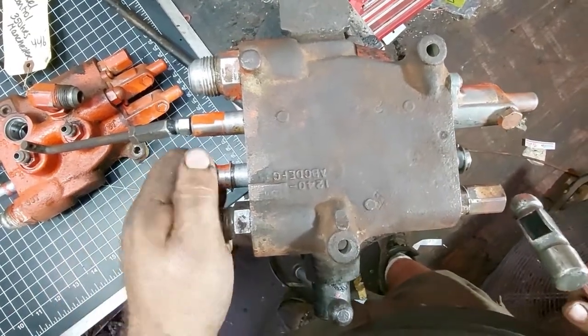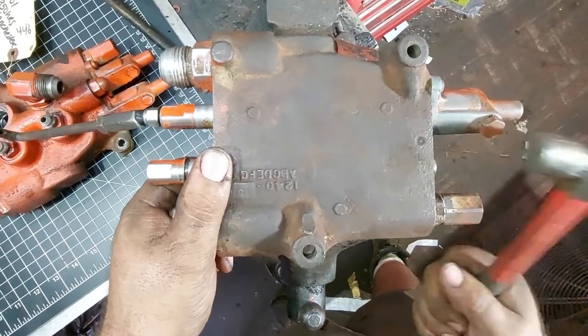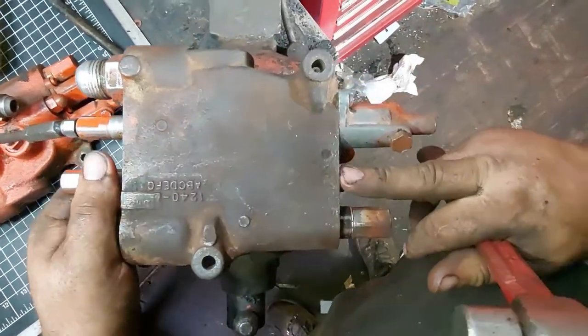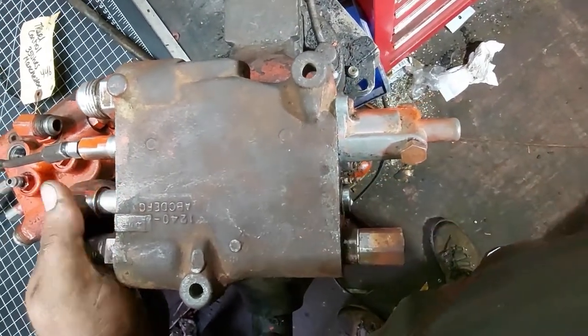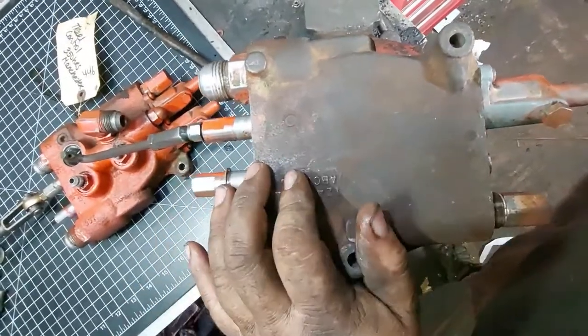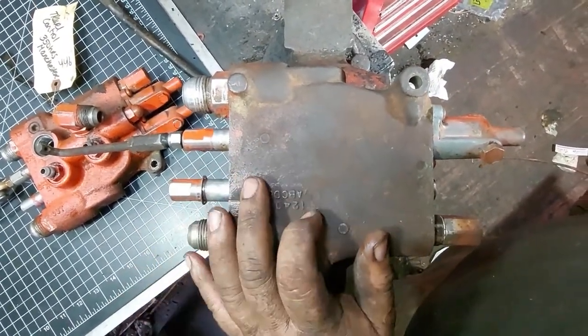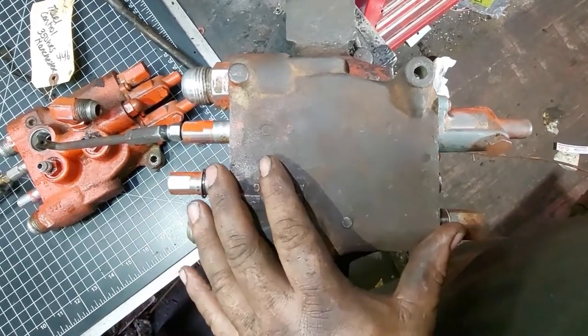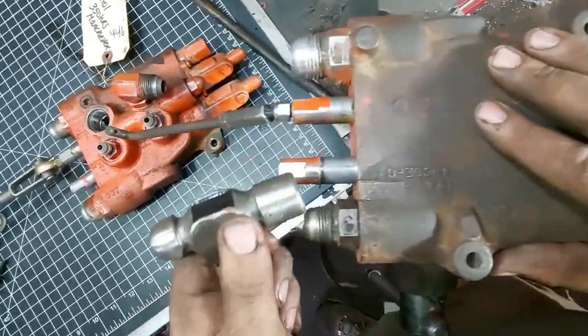So when your lever is all the way one direction, all the way in reverse, this should get pulled to where that snap ring stops. It can't go any further. So you always want to make sure your lever is pulling that. It should kind of line up top where your dash indicator marks are for forward and reverse, but if it's not going all the way over, it's not quite as important. So long as you're hitting these stops, that's an important part, and neutral is neutral.